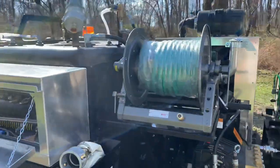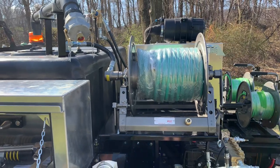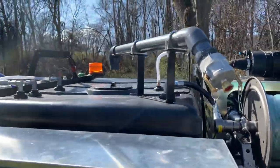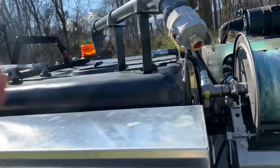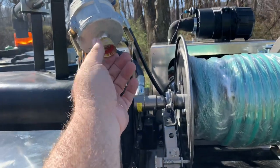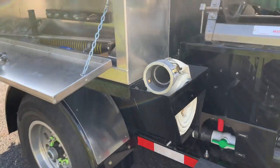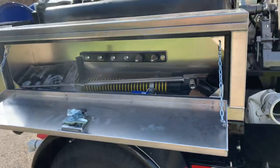This particular unit has a garden hose fill system — that's 100 feet of garden hose, 5/8-inch, and it's plumbed straight into the tank. That's optional. The unit comes standard with a fire hydrant hose fill system, which you can see there. It also has an adapter, so if you didn't get the garden hose, you can bring your own garden hose and just attach it right to that. It does come with the fire hydrant hose and the bracket to hold the hose in when you travel.